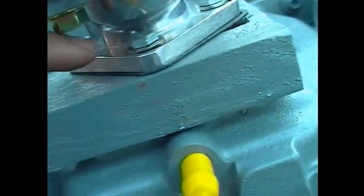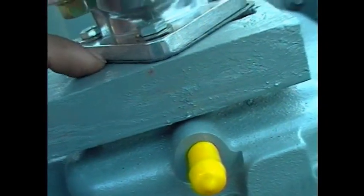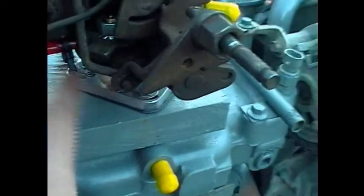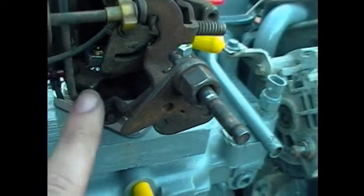They come in a bag of 4. This adapter comes with a 1-barrel gasket. I don't know the exact carburetor that you would buy the gasket for. And then this carburetor is a Holley, and even though it's an OEM carburetor, I think it does use the standard Holley bolt pattern. And this 1 to 2-barrel adapter uses the Holley bolt pattern.